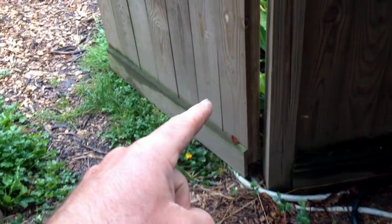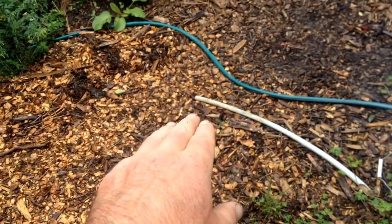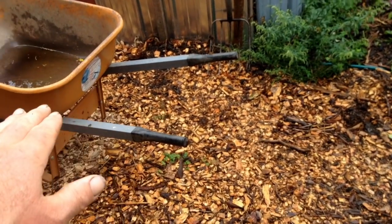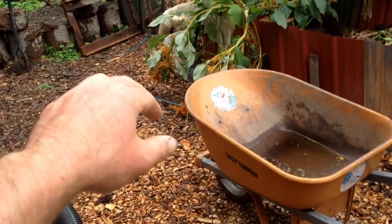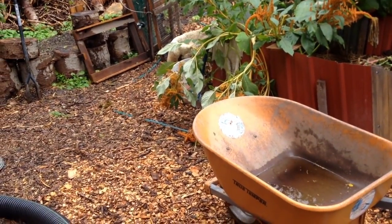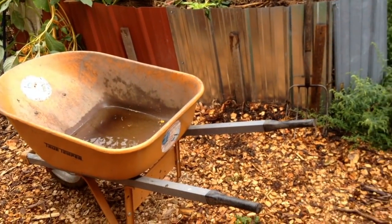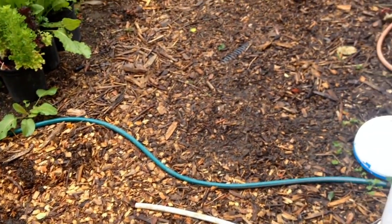This is heading northbound, and it opens into a sunlight area right here and basically pours into wood chip pathways, which all have wine cap inoculated through here. So it has a useful destination that's downslope and going away from the home. Pretty important to make sure that when they overflow, you ask where that overflow water goes, so it's not a nuisance, but rather a benefit.